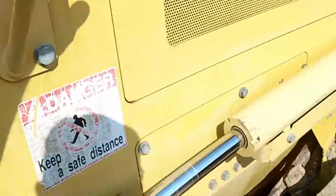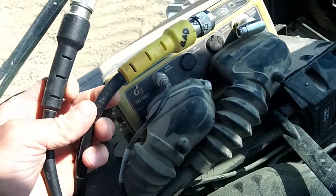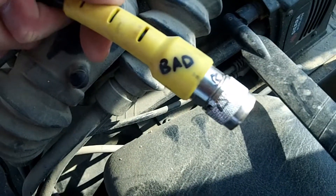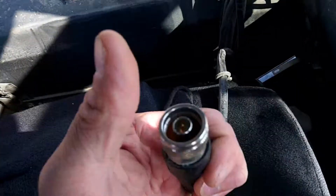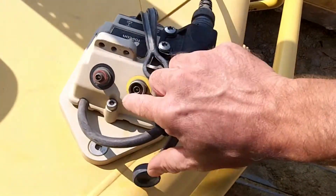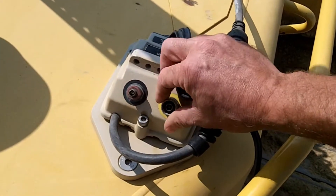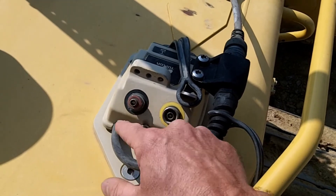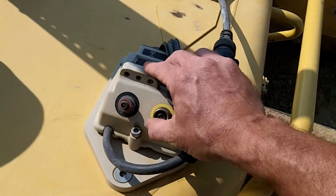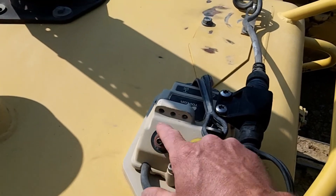The other thing I noticed when I came back to the MCR3 — they had two cables here. One looks like the original; somebody markered 'bad' on it, and the other is the one that was attached for the GPS. I took my multimeter and did a continuity check between this cable and the hood mount terminal to see which one it was connected to. It was connected to this one — you can see the little screw cap is missing — but ground came up on both of them, which was weird. So we're going to check that out and see how they actually wired this down. Ground only has one cable and it's either connected there or there; not sure why ground is hitting both, so we'll take it apart and see if we can repair it.